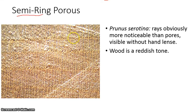One striking ID feature when looking at the transverse side is that you may have difficulty finding the pores because the rays jump out so quickly. The rays are very fine and very narrow — at first glance it looks like you have scratches in the end of the wood. The rays kind of block the pore pattern a little bit, and that will help you separate this from other species we'll learn later.